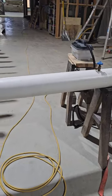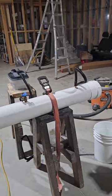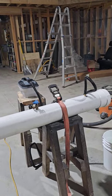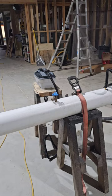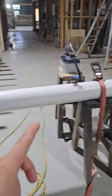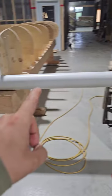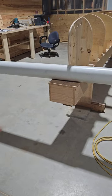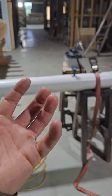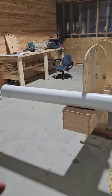The other thing I'm going to need to do is drill a hole at the back side to release the condensed water. Once the heat gets in there it's going to start condensing and create a water pool at the bottom. So when I steam, I need to angle it so the water drains down and falls out the drip hole at the back, and steam stays in the air — so even though I have a hole, I won't be losing my steam.